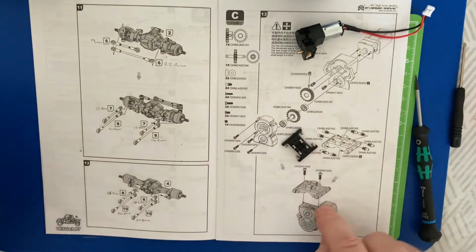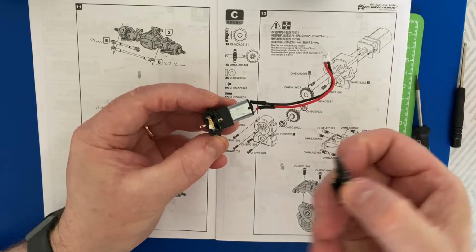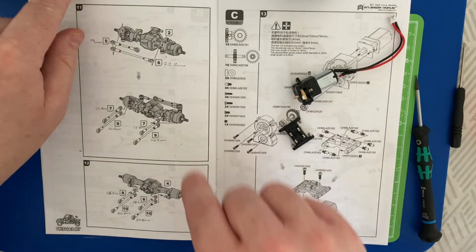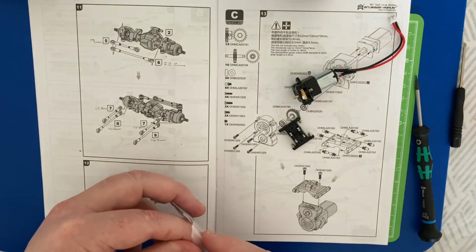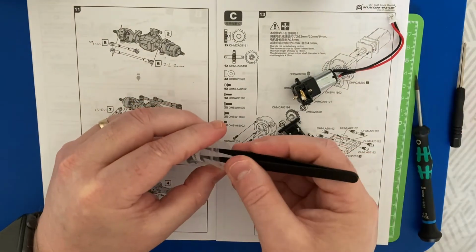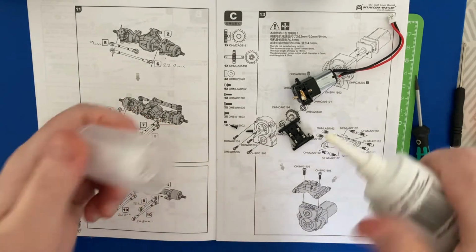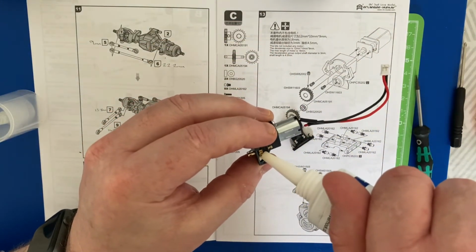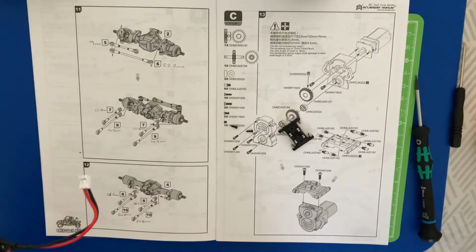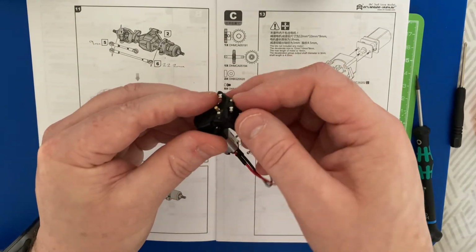So yeah, that's that section there, and we fasten this section onto the top of the motor, and we use a couple of AHSW 1505s. So it's 2 of those, and again they're in the bag. I think they are to scale on the drawing, but I take them out of the bag as and when I need to. So my nice tweezers, pop those in there, and just before I seal that up, pop a little bit more grease on top. There should be enough in there. This is quite a nice marine, waterproof, watertight, water resistant type grease. So that top now goes on top of there, and it should fit.